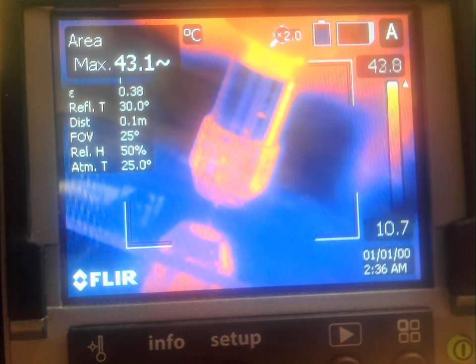We are depositing 0.6 millimeter diameter sterling silver onto aluminum oxide at 30,000 RPM, a surface feed rate of 15 millimeters per minute, a total feed distance on the surface of 10 millimeters, and a total Z-feed of 0.125 millimeters. So with no further ado, I'm going to spin the spindle up to 30,000 RPM and start the deposition.